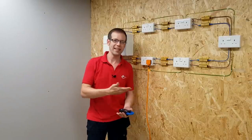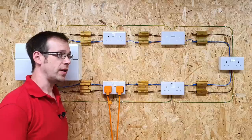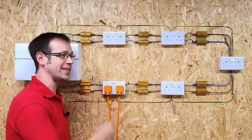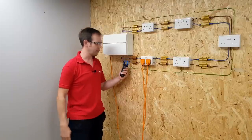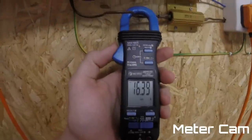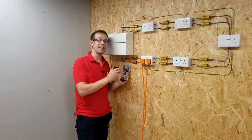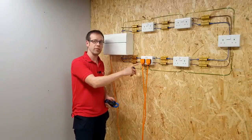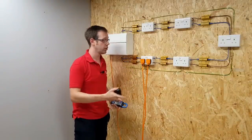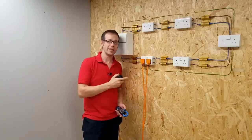At this point we might think that amount of current is not such a big deal. But let's load it up a bit more — hashtag more power — and see what happens. Now we've got about five kilowatts connected to the circuit. You can see there we've got over 16 amps running through this leg. Not a crazy amount of load — all I've got plugged in is a kettle and a toaster — but clearly more than 16 amps flowing.